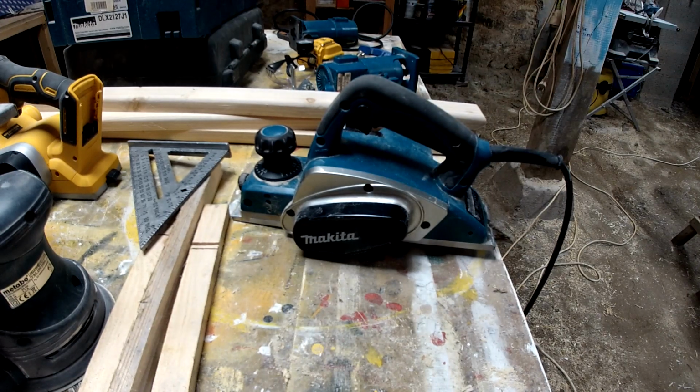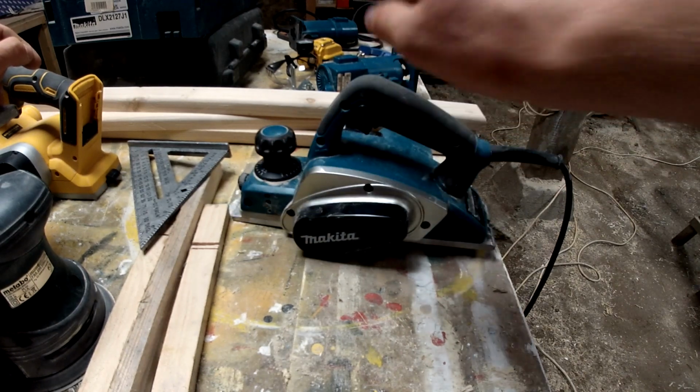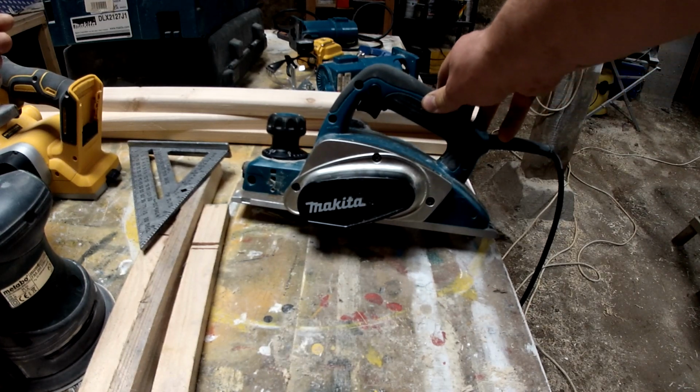And I should mention brushes, because I know that some people who are trying to sell brushless tools will go on about how you don't have to change the brushes on brushless tools. And although that is true, of all the tools I have, I've never had to change the brushes. Even my palm sander, my angle grinder, the planer, I've never had to change the brushes on them. So, changing brushes, yes, you will have to do it if you use your tools all day, every day, but it is a rare occurrence. It's not like every other time you pick the tool up, you're going to have to change the brushes. And for me, there are advantages to how simple brushed motors are over brushless. I'll take a brushed any day. Not to mention, with corded tools, you pretty much only have the option of brushed anyway.